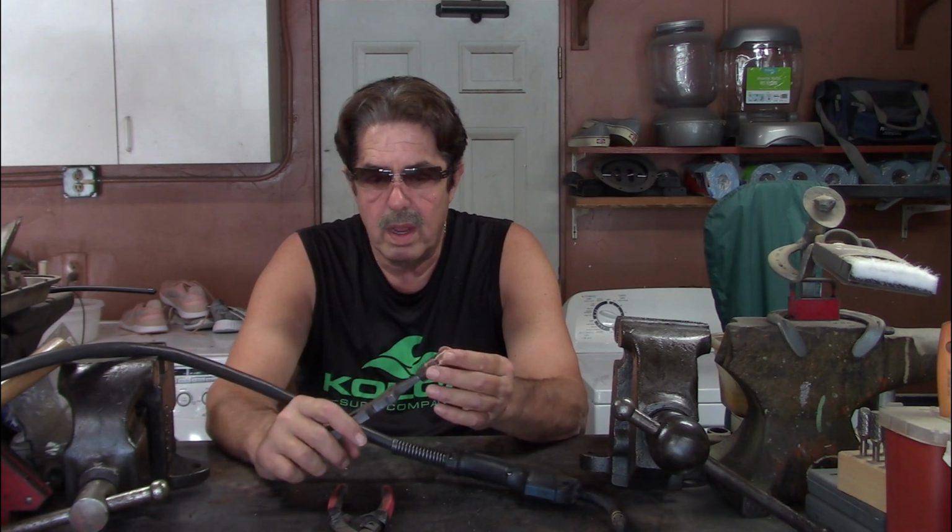Now, in the last video, you heard me mention I use anti-splatter spray. Some people use the containers of dip, but these are people, I think, who are doing a lot of welding. I'm just a DIYer, home hobbyist, and the anti-splatter spray comes in handy for a couple of things. One, I can spray the inside of this shield, which makes all that slag buildup real easy when I go to clean these. It just falls right out with a little twist of these pliers.